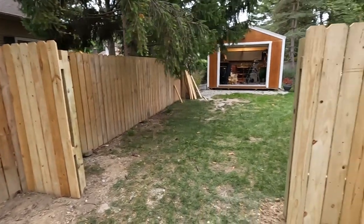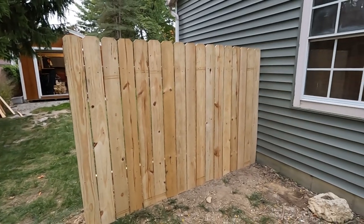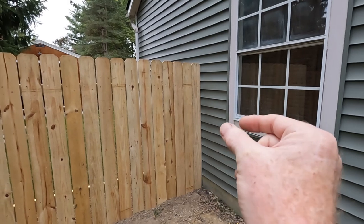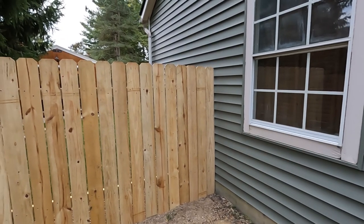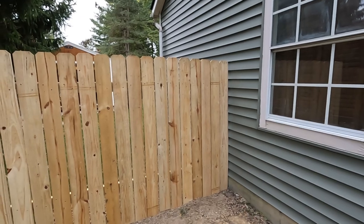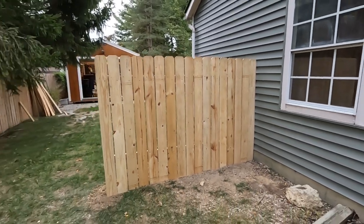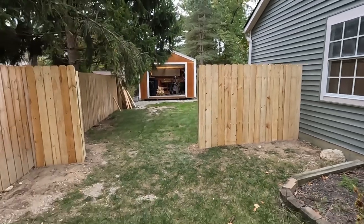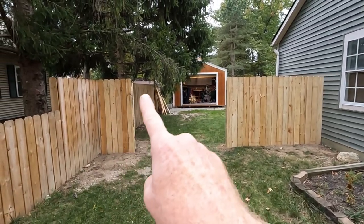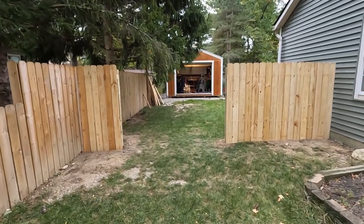You don't have to test it each time and the boards are pretty much consistently spaced. You're not building something absolutely perfect — it doesn't have to be dead on. But what I do is I just measure each board. I get up here and I say how far down from this top point to that top point am I, and then I cut off the bottom that distance. So like right now I'm at about seven inches up from the six-foot board — I cut seven off and it usually lines up pretty well. And just like that, the fence is done. Had to cheat a little bit at the end here — got my gap a little bit farther in. But it fits. I'm not a big fan of cutting it and just sort of having it hang there, but I can live with it. Nice and straight.